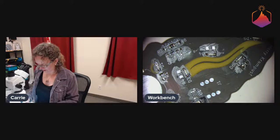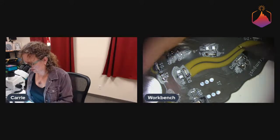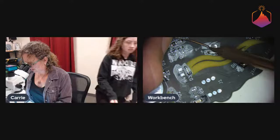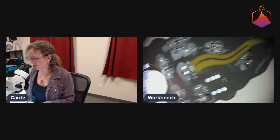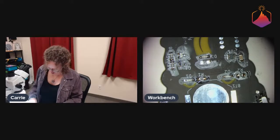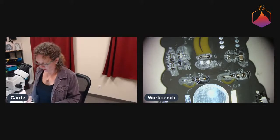So yeah, we do 2 at a time, which is kind of a good size for this board. And the panel also fits in our tiny reflow oven. We have a slightly larger reflow oven too, that we could probably fit 4 in at a time if we wanted to. But the reflow ovens I have are cheap, hobby, low volume prototyping equipment, so they don't have super consistent temperature throughout the entire bed array. So it's better to limit yourself to the middle of the oven.